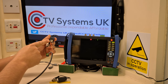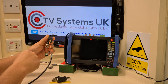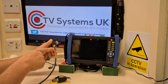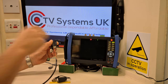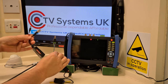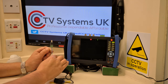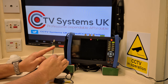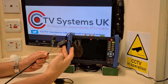On this particular balun there are little buttons you press that open a small compartment for the cables. Bare the ends of your Cat5 or Cat6 cables to about 5 to 6 millimetres. Press the button and put both orange cores into the grey terminal, which is the positive, and both brown cores into the white, which is the negative. That's the video taken care of. For power, strip the green and blue cores — green into the positive, blue into the negative on the 5.5mm power terminal. Other people may do it differently, but I like to use warmer colours for video and colder colours for power.